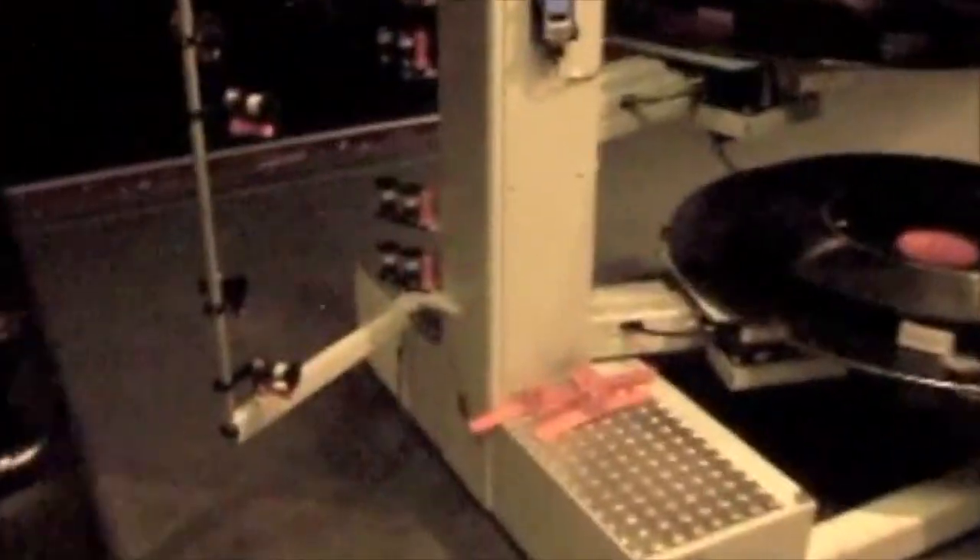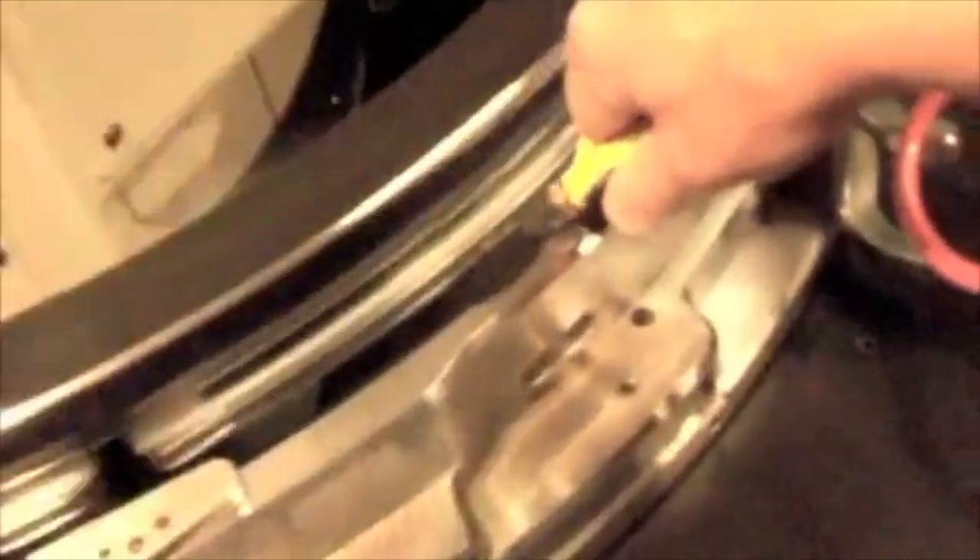And that's a film flattener. The film flattener is actually where the focus plane of the film is. It holds the film flat in the projection gate, and it also enables the film to go vertically up and down. If there's a bit of particles or dust in the picture, you can manually move it up and down to remove any debris. Just doing a quick blow of the compressor.